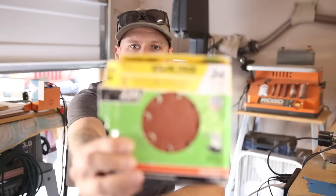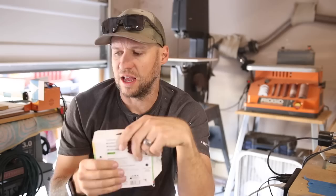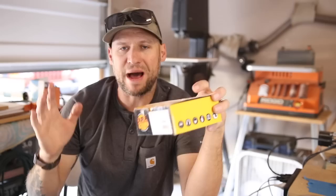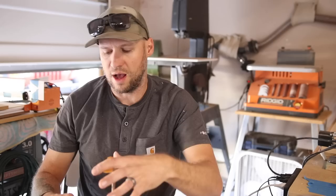If I need to buy something in town today because I ran out of a specific grit that I need to finish a project, I will run to Walmart and get the Gator brand sandpaper. They have the eight holes on it, which helps prevent it from clogging up faster and leaving extra marks when you're sanding. It is a decent quality sandpaper, and when you buy the larger packs like this 24-pack, it's really inexpensive. If I'm not pressured to get a project done today and I can order it online, I will order from Amazon — again, link in the description — Duragold. Duragold, for about the same price as the Gator, will get you an aluminum oxide sandpaper. It's this yellow-tint sandpaper. Aluminum oxide is just far superior — it clogs less and it lasts longer.